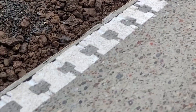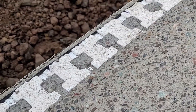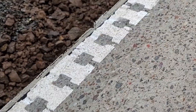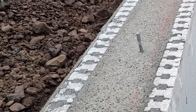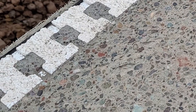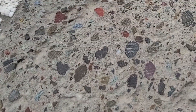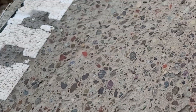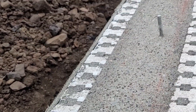When we had poured the concrete — I didn't show this before — we took forever to do the concrete with three trucks. The third truck was here before we'd even emptied the first one. By the time we finished filling the top of the wall, the concrete was starting to set, and it was really rough and hard to smooth out. So I ended up taking a diamond concrete grinder and ground it smooth. It actually ground really nicely and looked kind of pretty with the different colored rocks. There are a few spots where you can see it got a little bit of an indent where it didn't form very well, but overall it looks great — it smoothed out really well and turned out better than I thought.